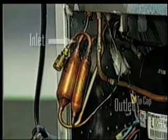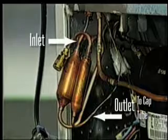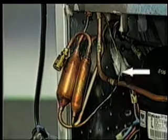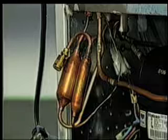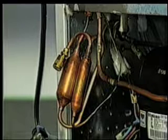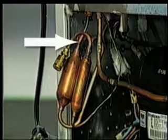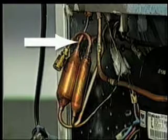It's very important that you install the dryer with the inlet above the outlet — refrigerant must be pushed up the capillary tube. Be sure to get one half to three quarters of an inch of capillary into the dryer to assure that you don't weld the end of the cap tube shut. Insert about a half inch of the hot tube outlet into the dryer filter.